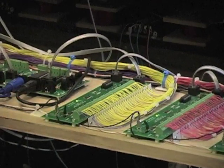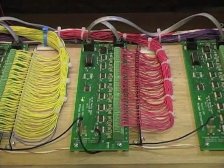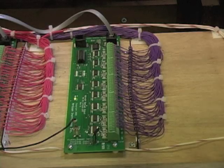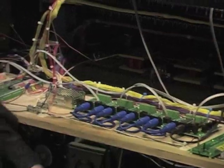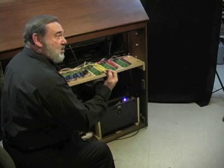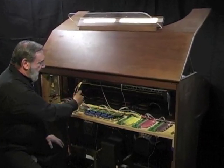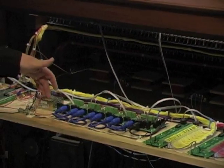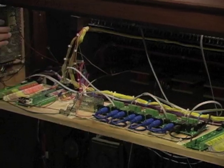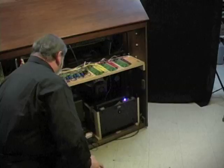There's one input board for each keyboard. The yellow wire goes up to the solo manual, the red wire goes to the great manual, and the purple wire goes to the accompaniment manual. Another wire comes up from the pedal contacts and goes into the input board along with the pistons. We'll show you what we've done with the pistons when we get around to the other side. Here we have our input boards, our computer boards, a little 5-volt power supply, a 12-volt power supply for the console lighting, our main power amplifier, and the artisan sound engine.